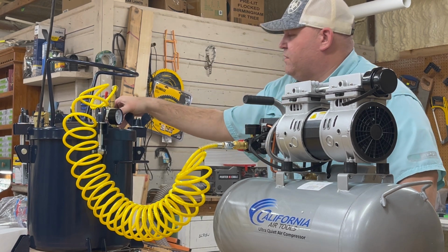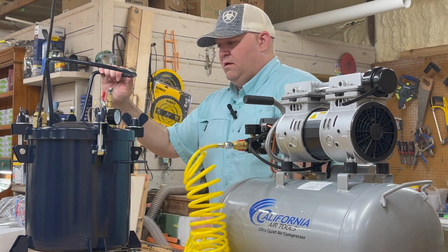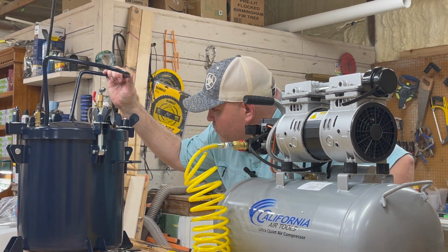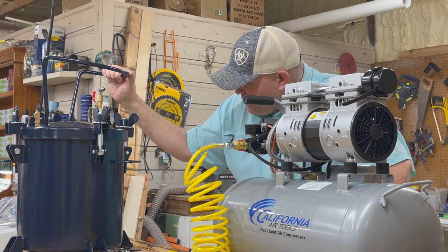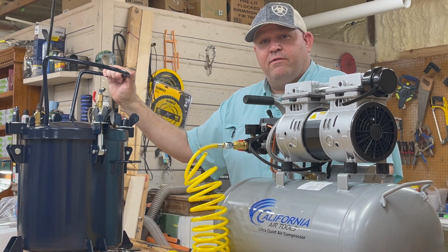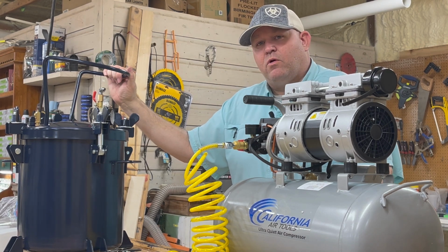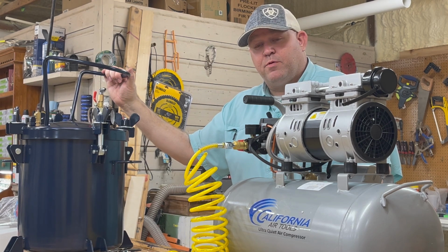All right, so we're just under 60 there. We're going to lock it down. Go ahead and turn the compressor off here. So we're right at probably about 59 on the meter here. And so we're going to leave it. And we're going to leave it for, we'll just say 30 minutes. 30 minutes to an hour. And then we'll come back and give it a check and see how she held up under pressure.